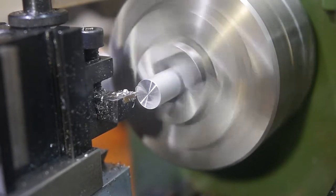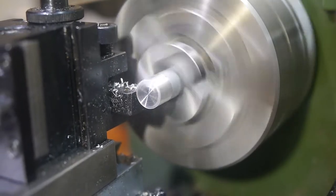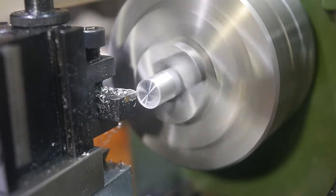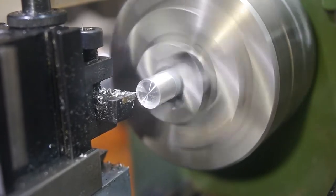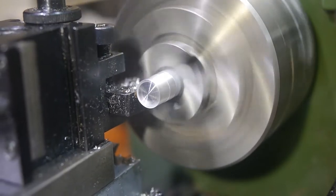They're not quite a complete solution yet, as they are drilled and threaded for an M8 thread, as is standard for the T-slot size, but all of the holding points in the faceplate are much smaller. I needed to make a fixture to allow me to clamp the plate down using one of the 4mm or 6mm holes into the 8mm T-slot nut.